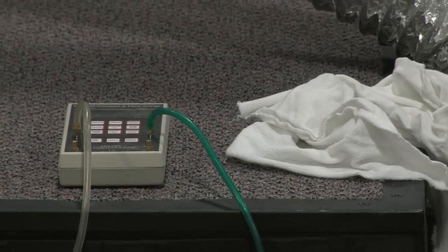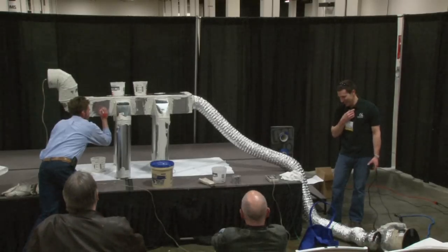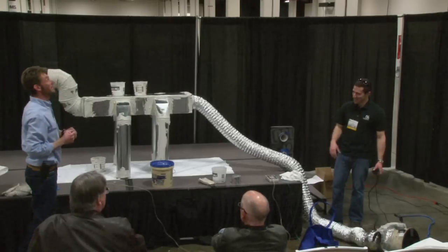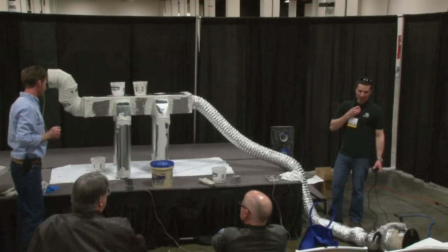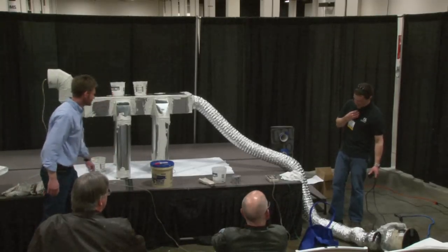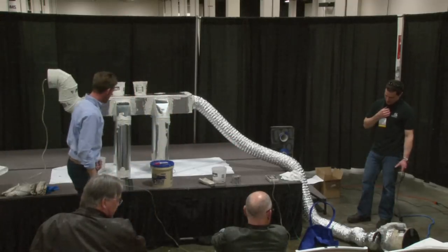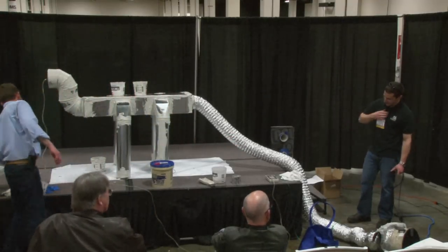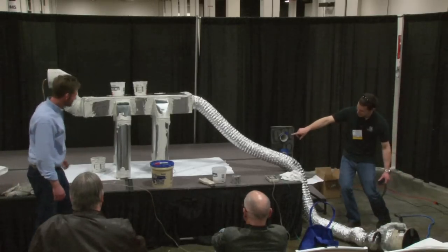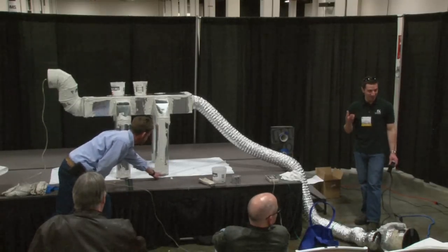Marie basically got this thing down to 18 CFM. You'll actually be able to come up and see this for yourself. From the beginning at 83 — where did you miss? It probably could be connection points, something at the bottom of the feet, the seams at the bottom of the feet. You didn't hit it, but again, it's those little tiny seams — you'd think they're done, but they're not.